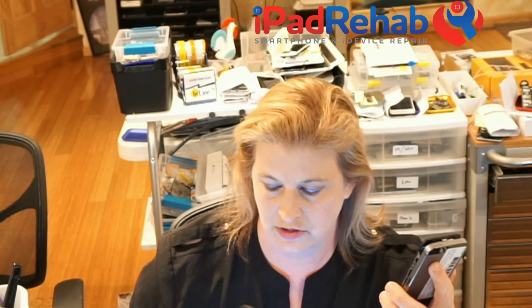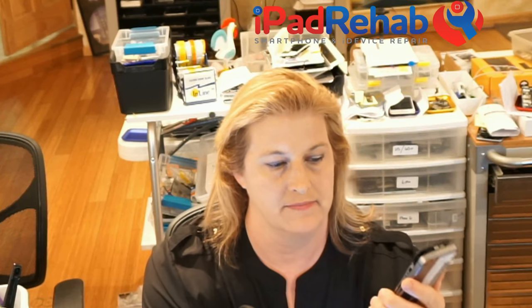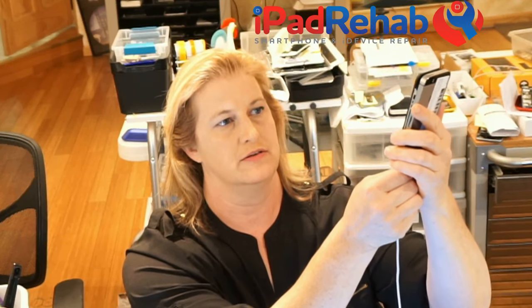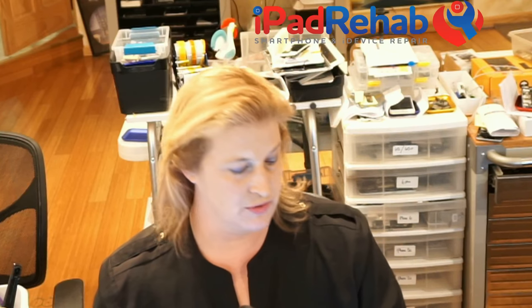All right, here's what I'm gonna do. I see the lightning bolt connector, so that tells me that the device knows that it's charging in addition to pulling charging current. So now it's pulling 0.9. I'm going to turn the cable around the other direction and see if it also detects in the other direction, and it does. Charging percentage has gone up on the device to 30%, which means it can detect the gas gauge in the battery, so there's no problem between the battery, the board, for gas gauge, and that, I think, is good. Now let's see if the computer can detect it.